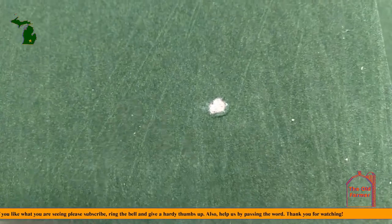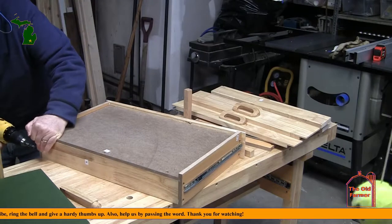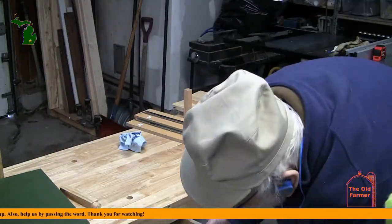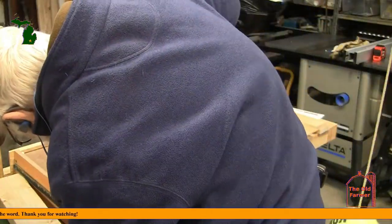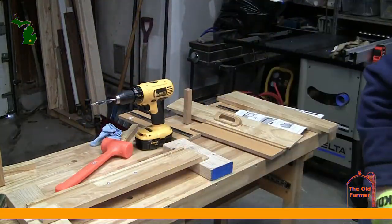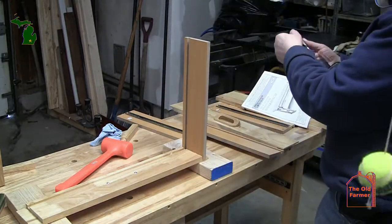You can see along the back there, where the screws are, that goes into a hardwood piece, and too many people didn't pay attention to it, so they had to do their own countersinks. I'm putting the drawers together and using a lot of adhesive. Along the way, I learned that I didn't need to use as much adhesive. I had a little bit too much squeeze out, and it was a little messy cleaning some of it up. So I learned to back it down a little bit.